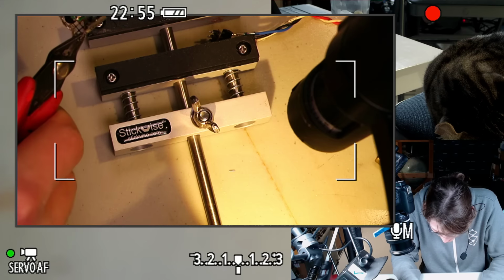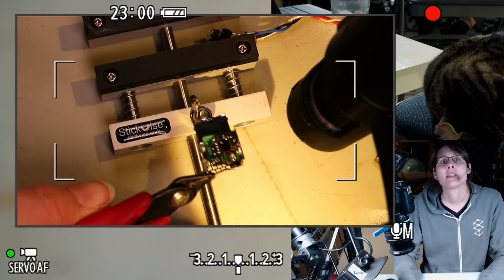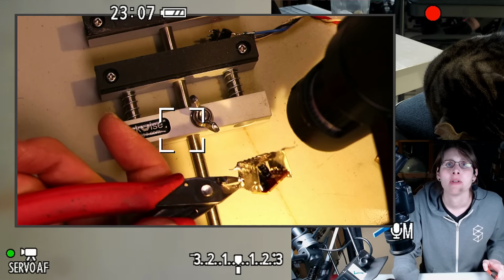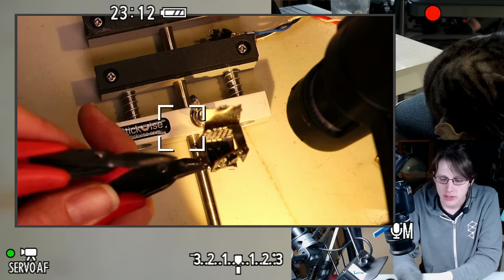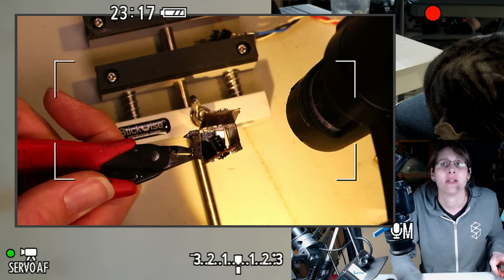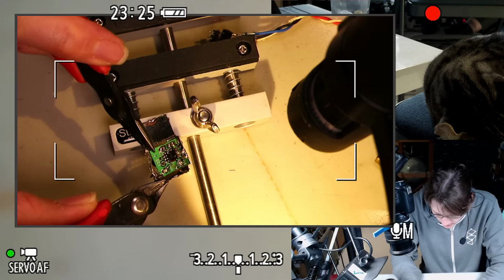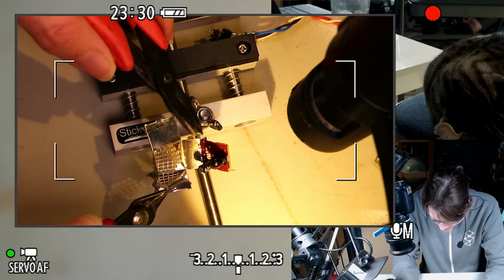Whoa, this is very old school, actually. I've seen devices like this, IR receivers that have an epoxy blob, but this one is different. There's an SO8 surface mount chip, which is going to be the amplifier demodulator, and then the actual photodiode is a through-hole part. Let's just see if I can break off that shield. Maybe not.